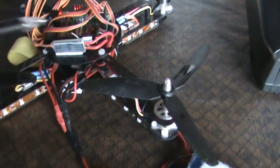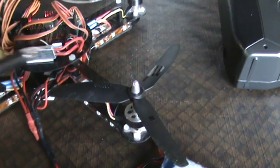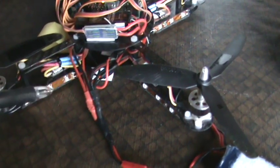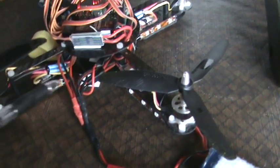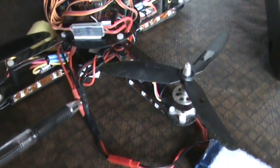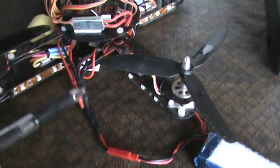Once you've done that, your other power wire that comes out of it goes directly to your load, which is my LEDs. Then all I had to do is take my ground wire from my LEDs and tie that into my ground wire that goes directly to my battery.